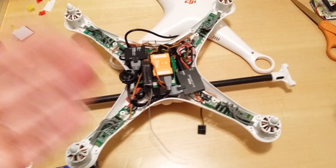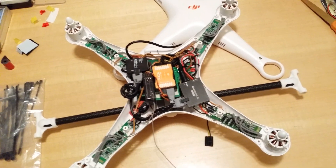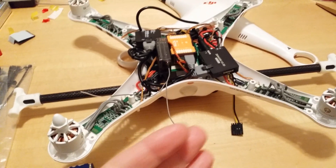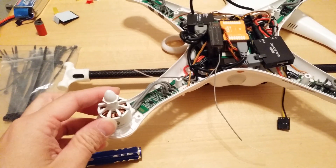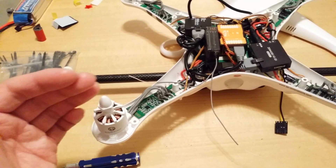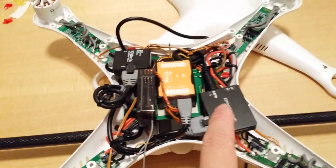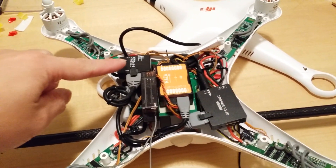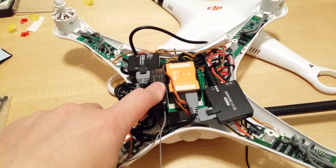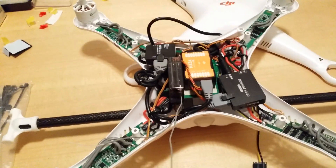Here is an internal shot of my modified and custom DJI Phantom. I installed a large variety of upgrade parts — I'm using the RC Tiger anti-gravity T-Motor sets and also the anti-gravity 9x3 carbon fiber propellers from profotouab.com. I have a Zenmuse GCU hooked up, a mini IOSD, and I'm using a full-size Futaba — this is the Futaba 8FG with long range.